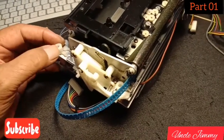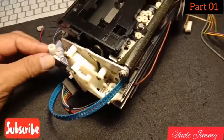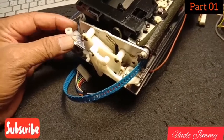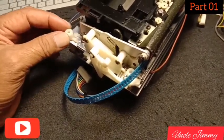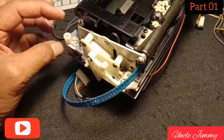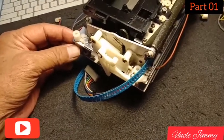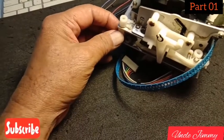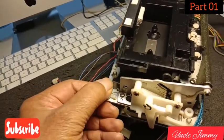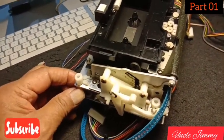There was a special way of clamping it down to get it in the correct position so that it's not tilted or anything. So that should be quite secure. I didn't use the screw to epoxy glue it to the main body of the transport, fearing that the screw might get glued in as well. The screws are actually a bit longer — when you install back into the chassis, the screw will go in a bit deeper and grab the main post, clamping this and making it a lot stronger. Fortunately, Nakamichi designed it that way.